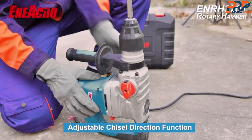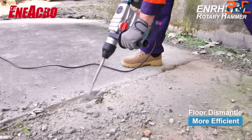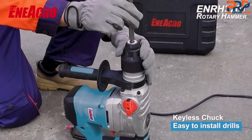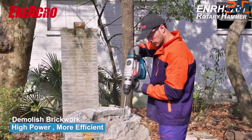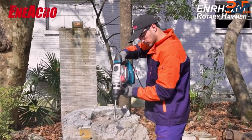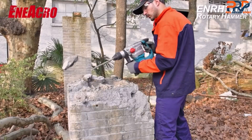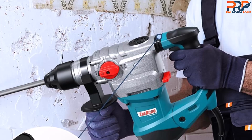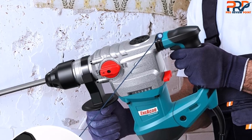This rotary drill does not have variable speed — there's a one-speed setting with a maximum of 820 revolutions per minute. The maximum impact when using the hammer modes is 4,200 BPM. As befits a tool with this much power, this is a large and heavy drill: almost 15.5 inches long, 10 inches tall, and it weighs 12.6 pounds, so you'll want to take frequent breaks while using it.